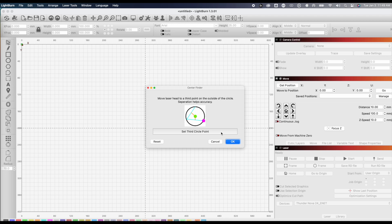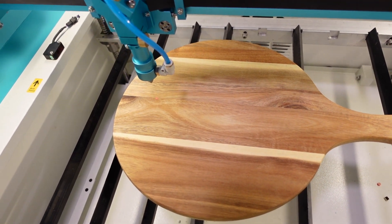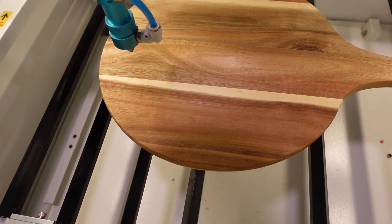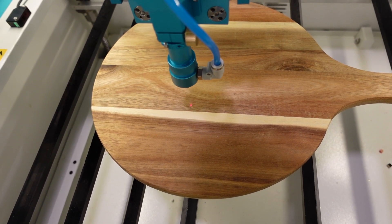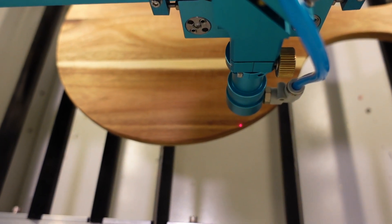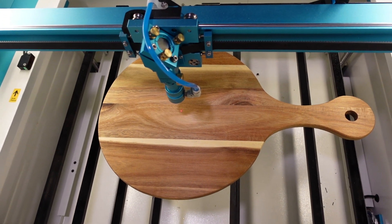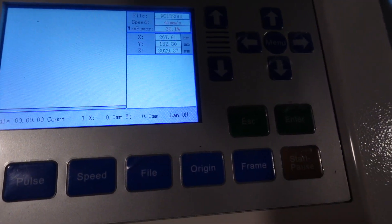Now we'll move on to our third and last point. We're going to drive up, and you can see that 31 millimeters per second travels quite slowly when going across the board — so if you're just moving the head and not getting precise origin points, you're going to want to speed that up. I consistently am changing that speed while I'm using the laser a few different times during every job. Great — love that right on the edge, so we are ready to set that as our third point. Next, we'll jog to the center of the circle and add a guide for the circle to the project, which will show up in Lightburn. Once you hit that center in the laser, you need to go over and set the origin on the laser — otherwise you will have to do this whole piece again, and you don't want to do that.